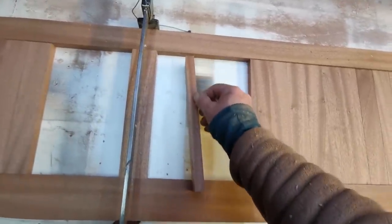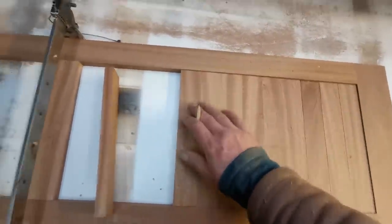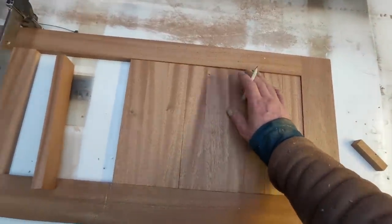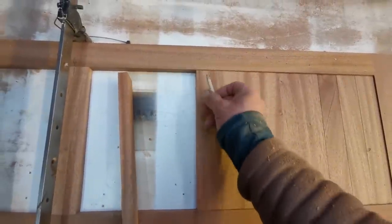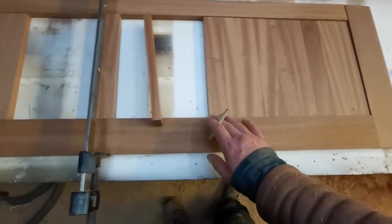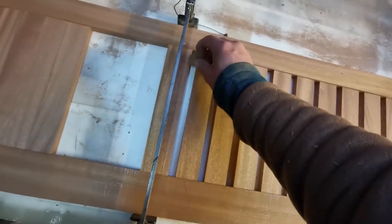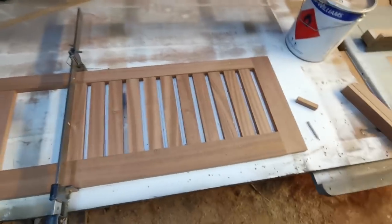I think I'll just be able to get an 8mm domino on these. I've set them back slightly, so I'm just going to sand this edge off. I want it pretty square, so this is essentially the back. I'll mark my centres, use them as my domino, so it'll finish flush on this side, but when you flip it over it'll be like this. Just set back a little bit, not that centre one. See, they all move very slightly, but I think that's what I want.